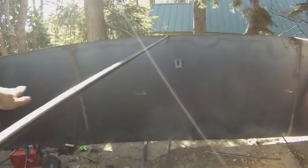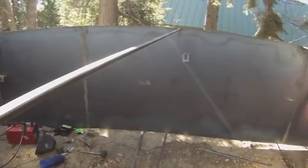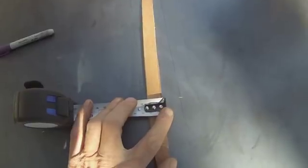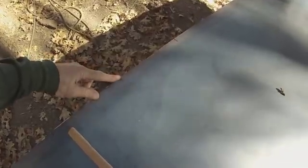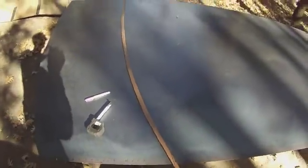I'll also go across horizontally every foot. I think I'll just buy some flat bar for that so I don't have to cut any special shapes. Each rib is going to be approximately 25mm wide. I've made marks at equal intervals for the top so I can try to stay roughly in line. I'm about 3mm off here so I'll adjust in small increments as I go to keep it roughly even.